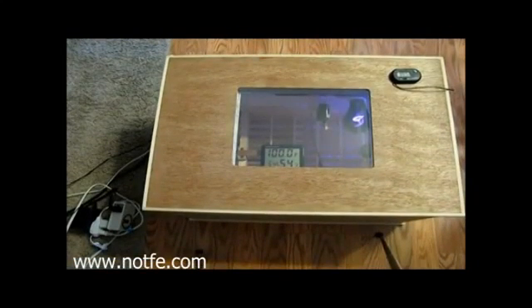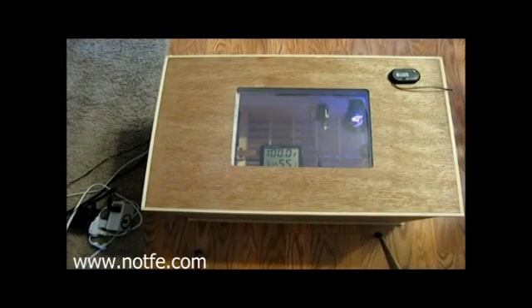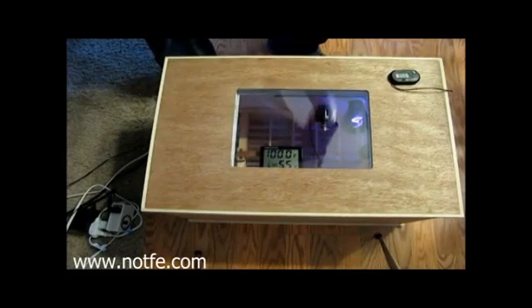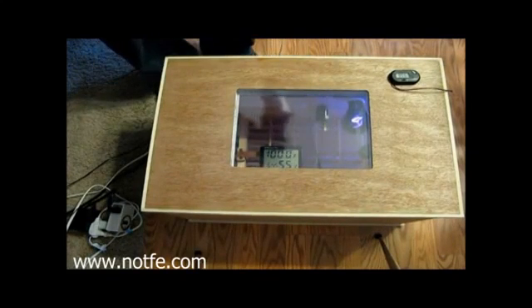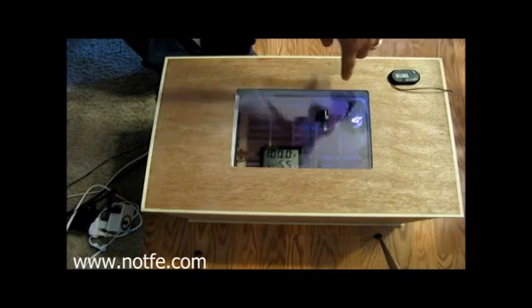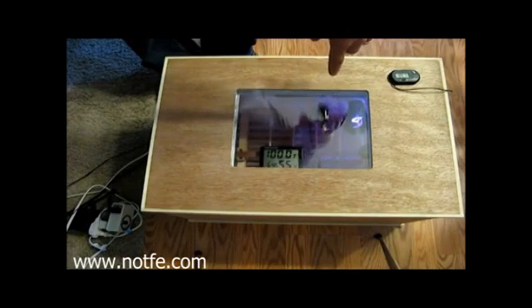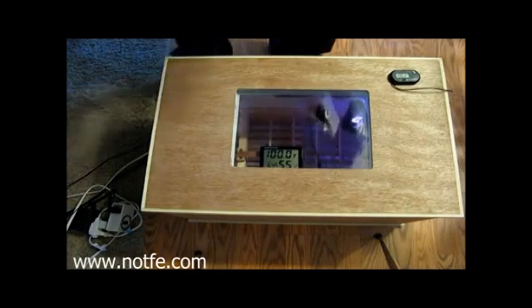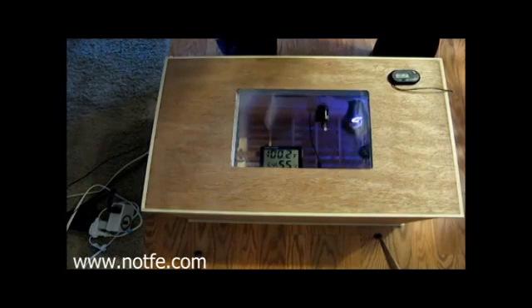Here's the finished incubator. I'll give you a quick rundown since the pictures probably didn't capture all the details. Over in the top far corner I've got a 12-volt computer fan that blows over a 100-watt nightlight for reptiles. Right next to it I have the water heater thermostat out on a little peg facing it, which might seem weird. Water heater thermostats are built to be on the side of a water heater, so they're not very sensitive unless they have really good contact with the heat source.